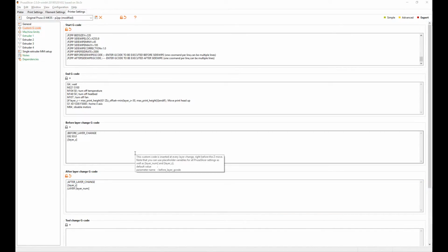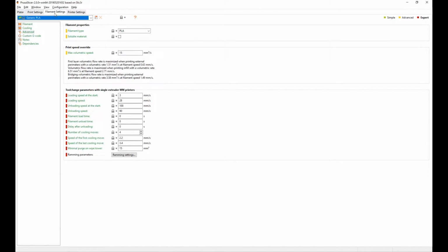Now let's configure the filament. There is a weird issue happening if you don't go in and change some setting on the filament. Like at the end of the print, it will go over the purge tower and dump a lot of filament there, independent of how tall the purge tower is. So if you have a model that has multiple materials at the bottom but not at the top, the head will stop producing the purge tower, but then it will go over the purge tower and dump filament there anyway at the end, like try to purge more.